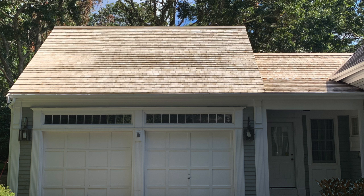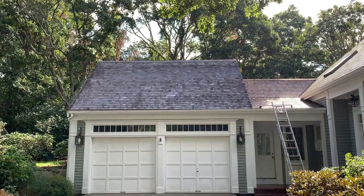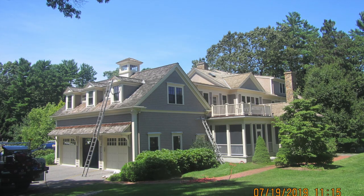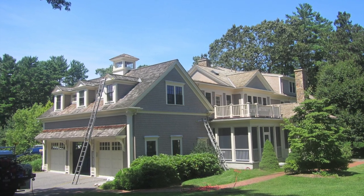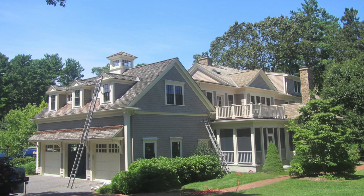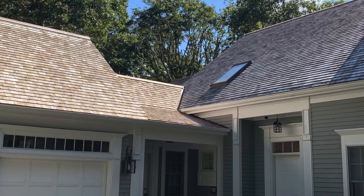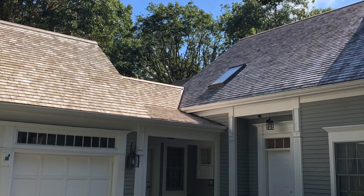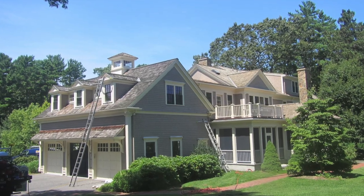This was a small roof, a small section of roof that I could do all at once. When I'm doing big houses, I try to divide it into manageable sections. I never try to do a big house roof all at once. I'm always dividing it into manageable sections that I can keep wet and rinse after 15 minutes, without any concerns about it drying before I've started to rinse.